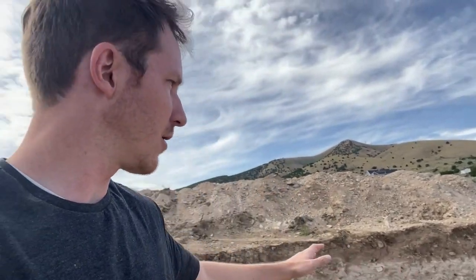So right here, we're gonna be doing 9-foot tall foundation walls. This is one of those choices that you're gonna need to make, or if you're building it for yourself, or if you're gonna talk with your client, you need to decide if you're gonna do an 8-foot tall foundation wall or a 9-foot tall foundation wall. And there is a common misconception with that. If you have an 8-foot foundation wall, you do not have an 8-foot tall basement, because you have a 4-inch concrete slab that's gonna sit on top of that footing, and that's gonna take you down about 7-8. You're gonna gain a little bit with 1.5 inches at the top, and then you're going to lose a little bit, so you end up right about 7-8 is about the finished height. So same thing with a 9-foot, it'd be about 8-8.